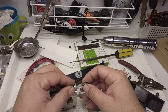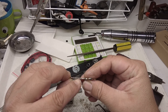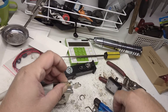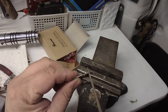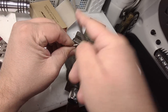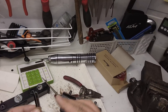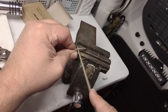That way it's going to work on both sides. I give myself a mark — yep, I've got a little tiny mark right there. I'll go for a better one. This is just to find the center; I need to make sure I'm on my mark. I've given it a quick scribe and I look down the barrel to see that my mark is actually on track. It's a little bit off, so I'm going to move it over a bit.